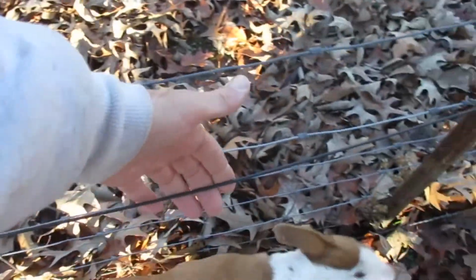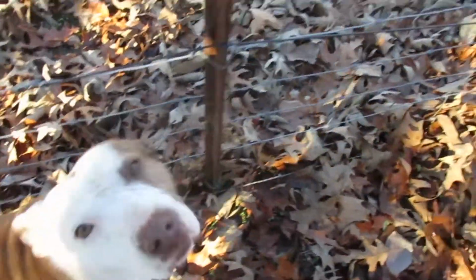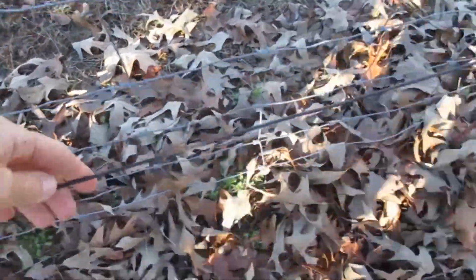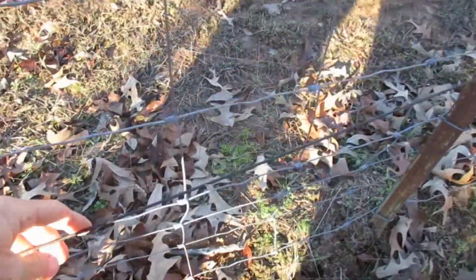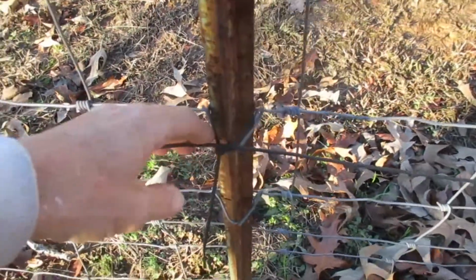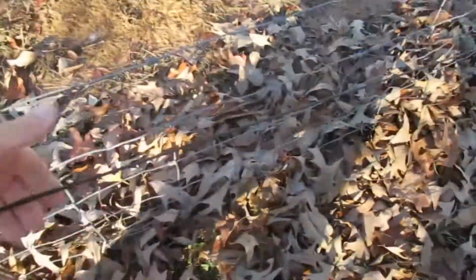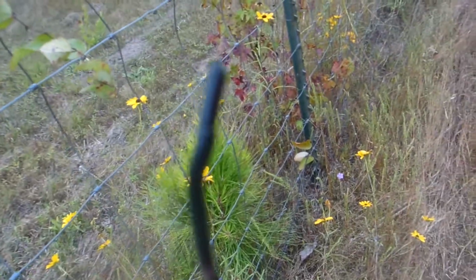When I ran my wire along the fence, I figured it would be best right along the middle. That would be the easiest, and the dogs wouldn't be able to dig out or jump over without feeling a shock. But after having had this for several years, I've concluded that was a mistake. It's too easy for wild animals and my goats and ponies to chew on the wire. Very frequently, I hear the sound alerting me that there's a break in the wire.